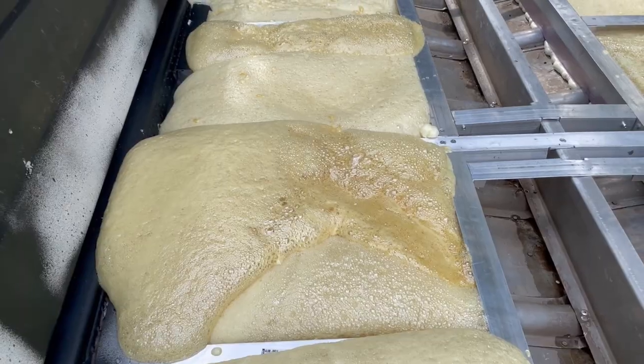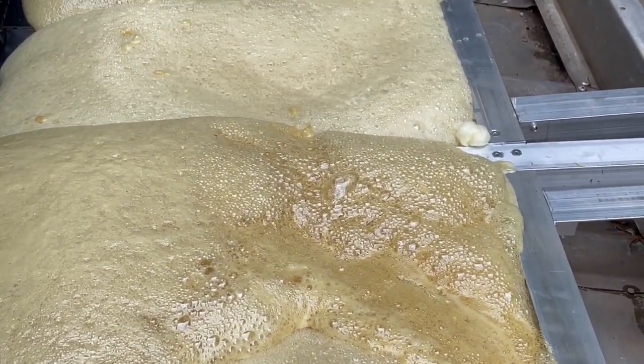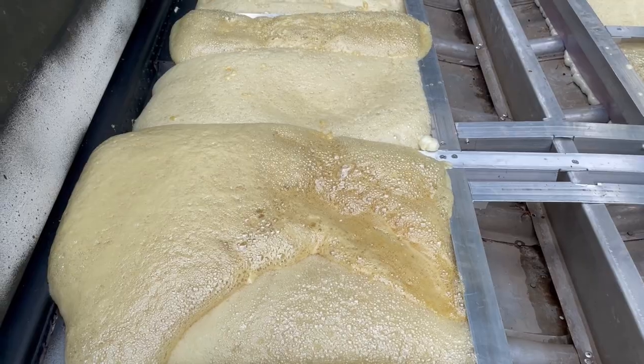The thing you want to do is measure precisely — our measurements were not precise. Also, don't stir it with wooden paint sticks; get yourself a drill attachment for mixing this stuff up. It rises too fast for sticks to work because the resin sinks to the bottom of the mixing bucket. We found out that when you have more resin than activator you get big bubbles, and the bigger the bubble the less dense the foam is. You want your foam to be as dense as possible to avoid air pockets.